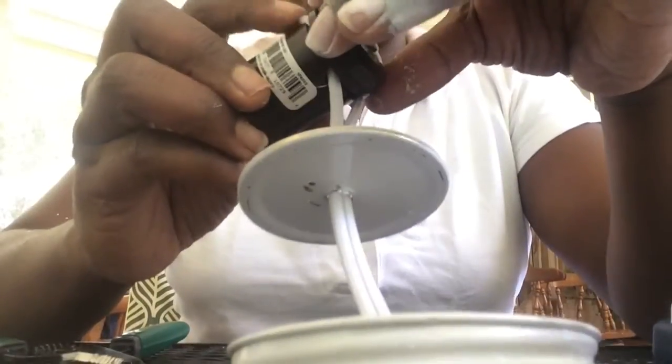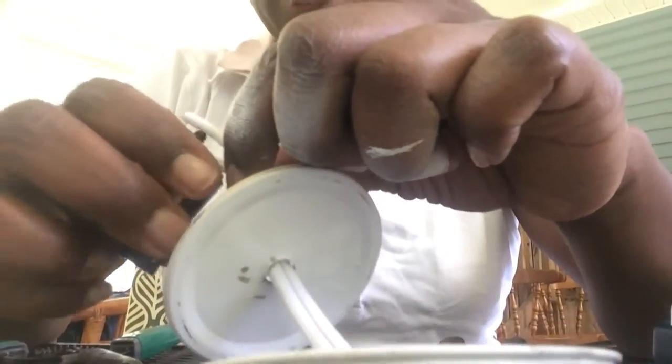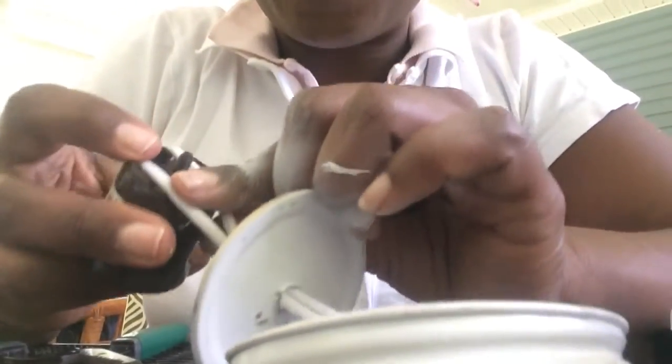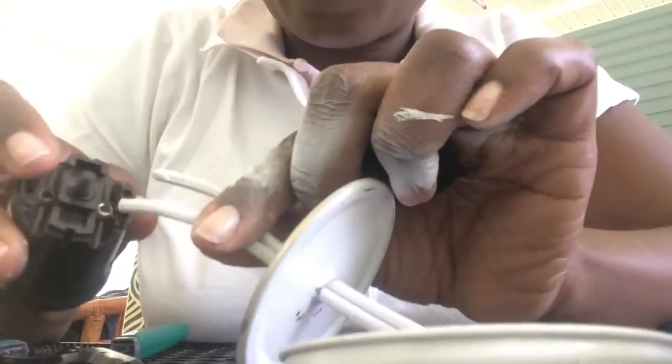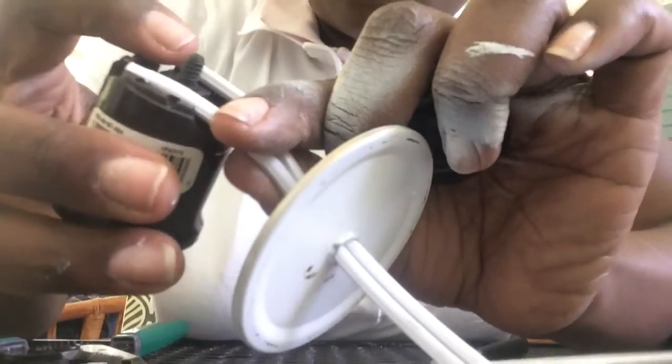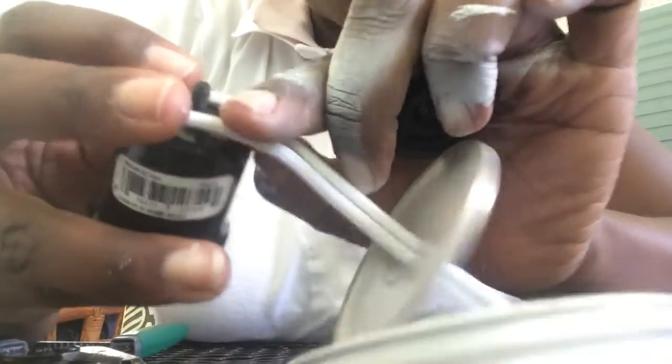You can find all these pieces at Home Depot or Lowe's, whichever you prefer. I shop around to see what's new; these things are no more than a dollar fifty. With the wires sticking out here, I'm going to back it up a little bit because I want to make sure it doesn't come in contact with anything potentially conductive. As long as it's coming in contact with the two tabs that come up — those pointy tabs are what stab through and make your connection — I'd have it back as far as you can.